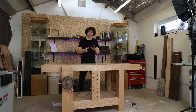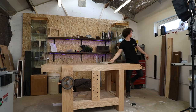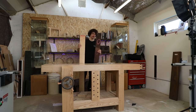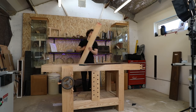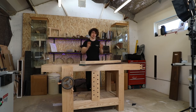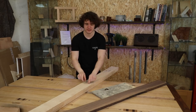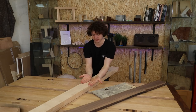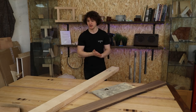If you haven't already seen the three-part series I did on designing the bass guitar, go back and watch that. As a quick summary: we've got a buckeye burl top, and an ash neck with a walnut laminate sandwiched between the ash. The construction is a through-neck, meaning it goes straight through the body with the body joined onto the sides. In this episode we're making that through-neck — ripping the ash in half and putting the walnut between them, along with two layers of veneer for extra strength and a little inlay line.